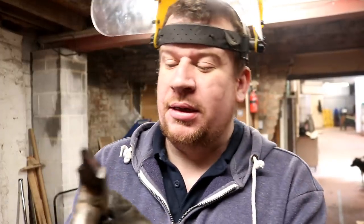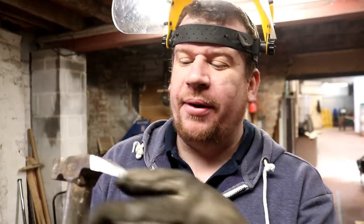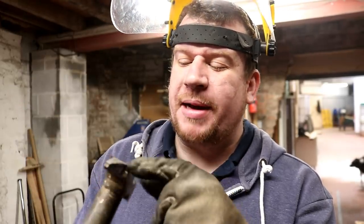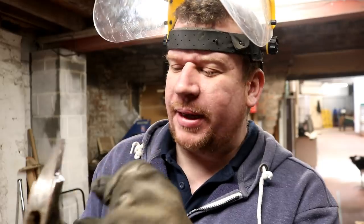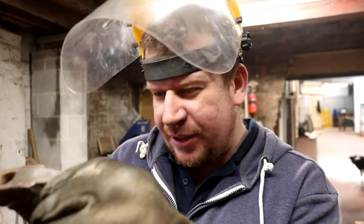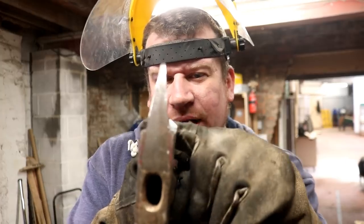Well, that's a lot easier than I anticipated. I've basically chunked off two sides to make a point — it's more like a pick now. What I'm going to do is go back in with a grinding disc and round the edges off, smooth everything out a little bit, and maybe just bring these two sections level because I'm slightly off with them. A bit more work with the grinder and that will be ready to go into service.